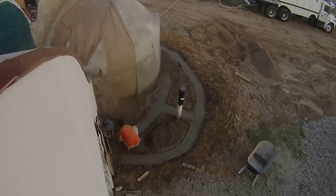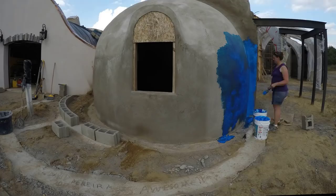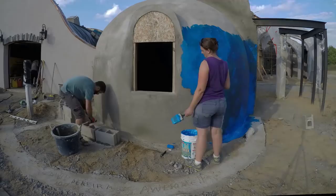Generally speaking, you would completely bury an apse at the back end of an earth shelter somewhere. They're very strong in that sort of compression, fully buried situation. Instead, I put windows in all of my apses, which makes them particularly difficult to bury. My idea here was to build a retaining wall around this apse and then punch a window that went through both, so I could have the best of both worlds — full burial and have light.